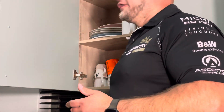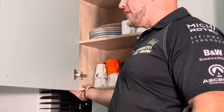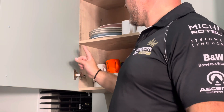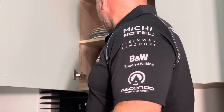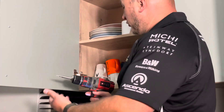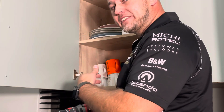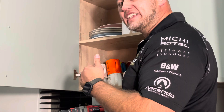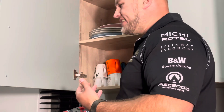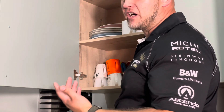This next one is a bit more difficult while holding the camera. What you want to do now — you will see there is play on the door as you push it up. You want to push this door up as high as you can on the mounting screws that you have. A little trick that we do: I will take out the top screw, push the door and the hinge up as far as possible, and put the screw in a little bit higher. That is going to set it where we want it and then you can sort of leave it — it is going to hang on its own weight and it is higher. If you only lift it up and put the screw in you are going to gain a bit of height, but if you don't have someone to help you push that door up it might just drop down again and you might not get the desired effect.